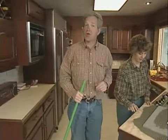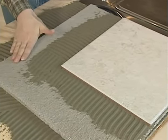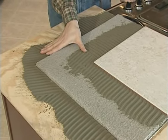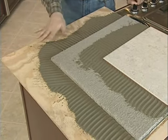If you're thinking about installing a ceramic tile floor, you have to understand what goes underneath it and how that's going to affect the final height of the floor. If you stack up all the elements that you need for a good ceramic tile floor, then you'll end up with something that's a little over an inch thick. You've got the tile, and then the cement backer board underneath that, and then the mortar to set the backer board to the floor and to set the tile. Plus, we ended up putting down a 1/4 inch plywood underneath everything.